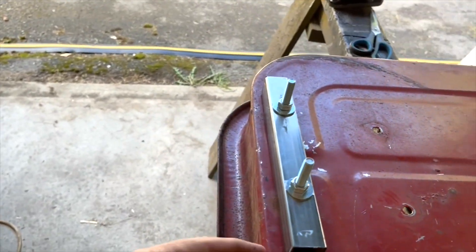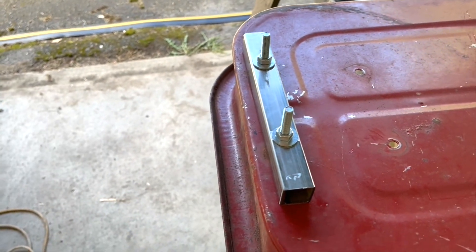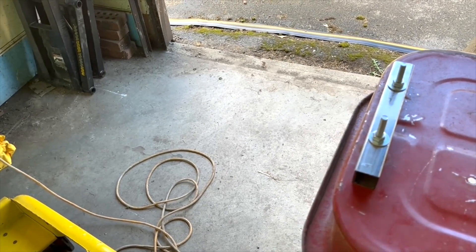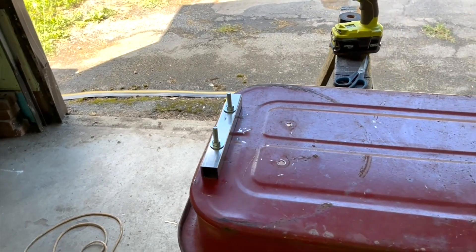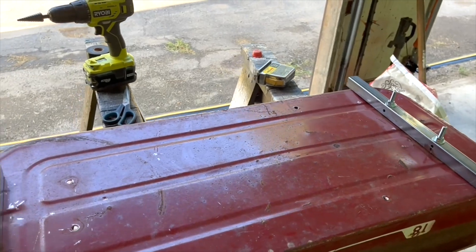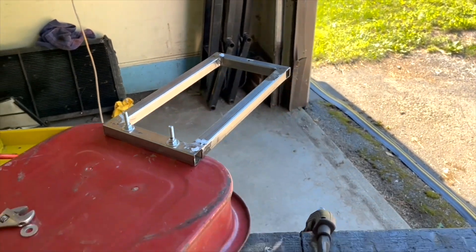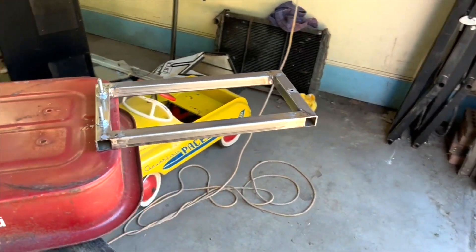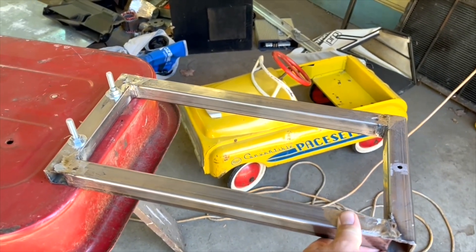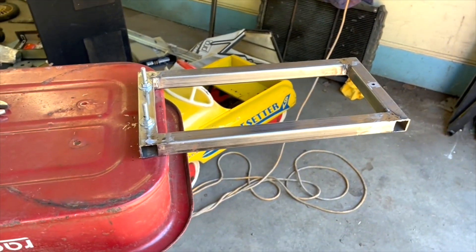Off the front I'm going to go two 14-inch pieces from here out, then another eight-inch piece to make a big box, and that's what I'm going to bolt my front axle onto. Everything will just bolt right up to the wagon. The front's done and boxed in — I'm not sure if it's going to be a problem regarding stability, but it's pretty tight, doesn't seem to bend much, and it's just going to be sitting on top of an axle, so I don't think that's an issue.